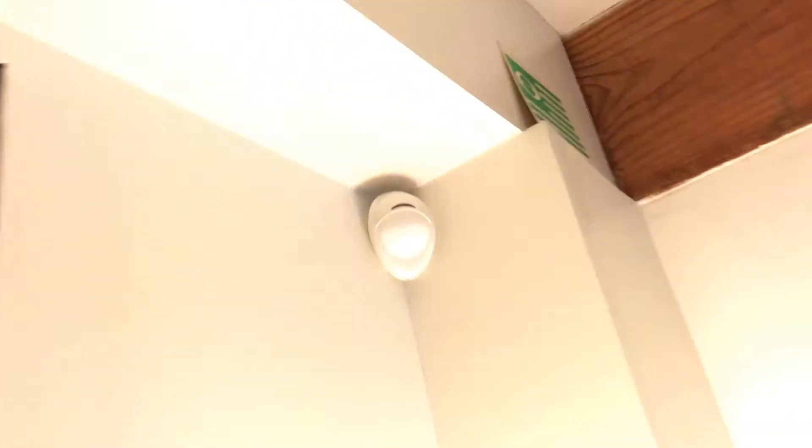Heading downstairs, here's the garage door — it has more contacts right there with the magnet. We open the door and you might have heard it because there's a keypad down here as well. Over here in my father's office we have a motion detector. There's a big window that somebody could easily get in through and it opens outward, so it's unable to have contacts on it, so I installed a motion detector right there.